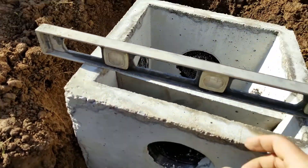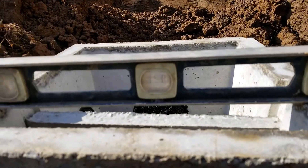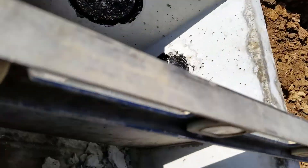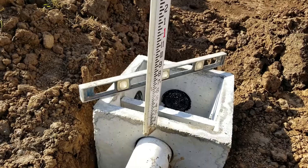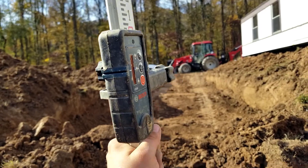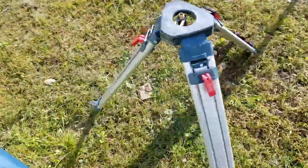The first thing we're going to do, just real quick, is check to see if it's level. We can see that the right side is a little bit higher. There we go — we're going to come down on here. All right, guys, we're good. Turn this transit off. We've got the two D-Boxes where they need to go.